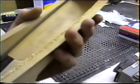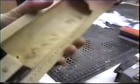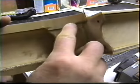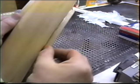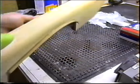We're going down to make some aeropoxy fillets. You can see what I've been doing is leveling this off, evening this off. We roughed these in on the last video. I want to get this even here, take the rest of it out with my little wizard tool, and then even this up so this is exactly the same thickness front to back, that whole saddle, and I'll do that with a piece of tape.